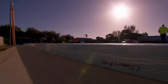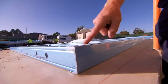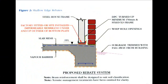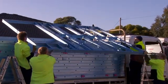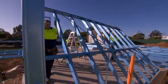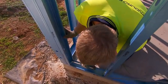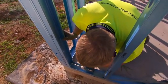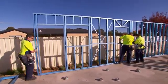Mark a chalk line on the inside of the wall positions on the concrete slab or platform floor. Where wall bottom plates are not pre-painted, an impermeable membrane such as polyethylene should be installed under the wall frame to isolate it from direct contact with the concrete foundation. The membrane should extend up the weather side of the flange of the bottom plate. Unpack and lay the wall frames close to their intended position according to the drawing. Starting from one corner of the building, stand two frames to the chalk lines to make a square corner. Screw the panels together using hex head screws at the top and bottom plates. Continue standing walls and attaching them together, working outward from the corner.